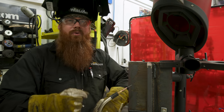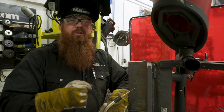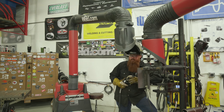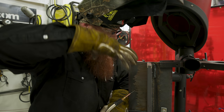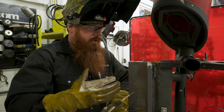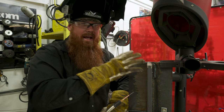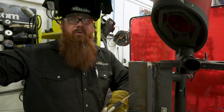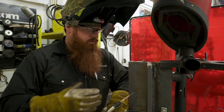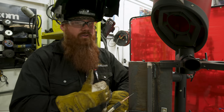This wire is recommended for outside use. Since we're welding inside, I highly recommend good fume extraction — I actually have two fume extractors here to catch all the smoke. You don't want to stand over top of it and draw that fume over your face or your welding hood. You always want to pull the smoke away from you versus past your face — you don't want the smoke to have to go past your face before it gets sucked up in the fume extraction. Keep your head out of the fume plume. There's some potentially nasty stuff you don't want to breathe in.